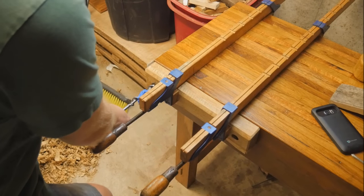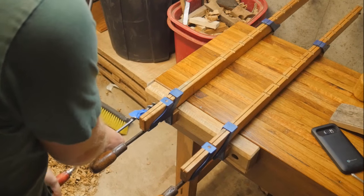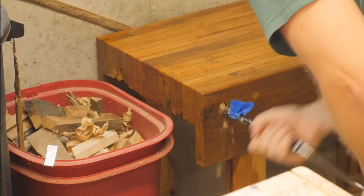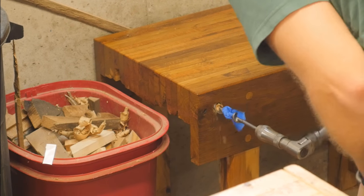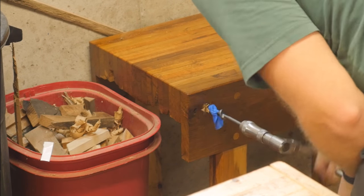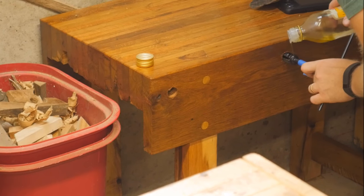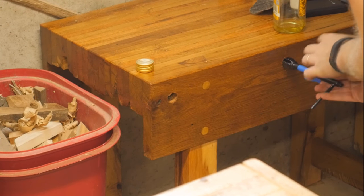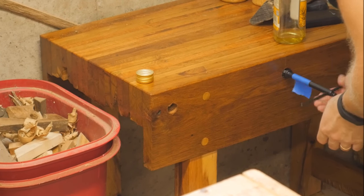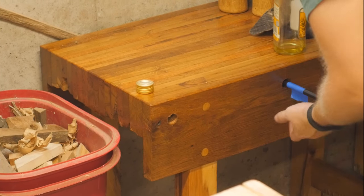Now that I have the chop all glued up I need to drill through to mark the holes into the bench top. I'm clamping it in place so that I can drill all the way through the chop and into the bench, and that leaves a small mark in the bench that I can then come back and drill out the hole for the threaded rods. That way I can make sure the chop is completely and perfectly in line with the holes in the bench. I need to tap these holes in the bench so I can screw in threaded rod - these taps you can get on Amazon and are very useful for this. I put a little bit of oil on it and make sure it gets a nice clean cut all the way through.